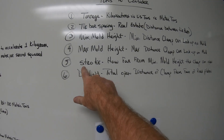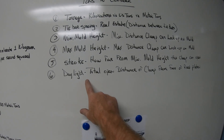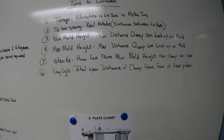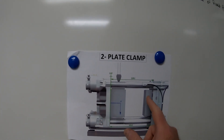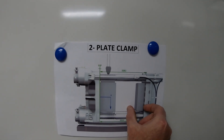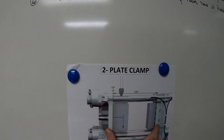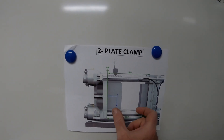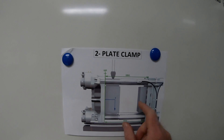Your stroke is how far the clamp can open from the minimum mold height. Daylight is the total open distance of the clamp from the face of the fixed platen. In practice: minimum mold height is the distance at its closest position, maximum mold height is at its most open position, and daylight is the opening stroke with the mold installed — giving you the area to eject the part.